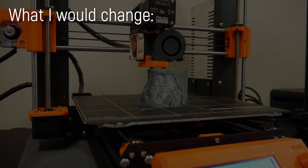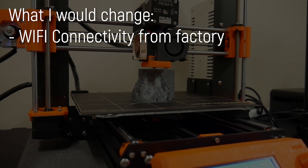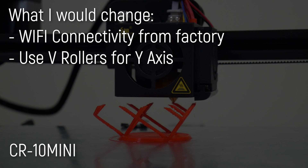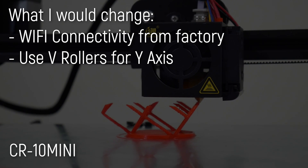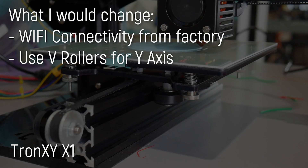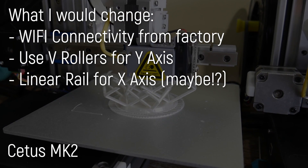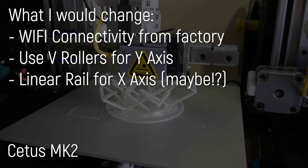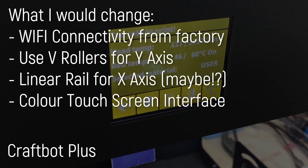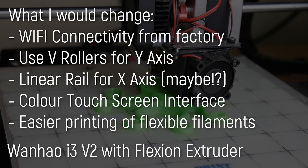I'd like to list things I would have liked to see in the Mark III: Wi-Fi built in — not an option you add. And considering the machine has moved to extrusions for the Y axis, why not also move to rollers, like we've seen on some other designs? High quality V-rollers create incredibly rigid smooth linear movement and could make the machine even quieter. Similarly, a linear rail for the X would be really nice, and I would love to see the interface replaced with a color touch screen.